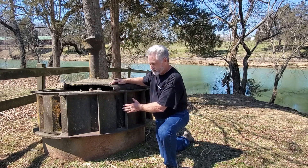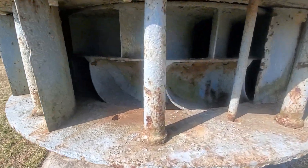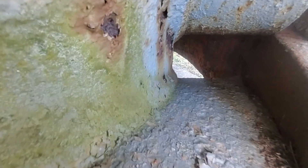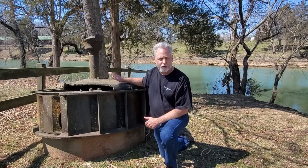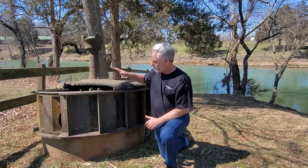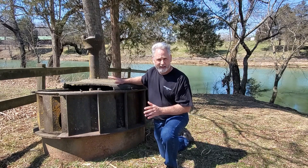When you open these hatches — these little doors here — the water races in and there's an impeller inside that turns under the weight of the water. These were a more efficient use of water because you could get more horsepower out of them. You will see these in some of the bigger mills and some of the modern mills from the 1900s on.